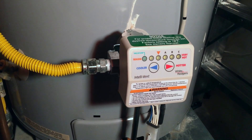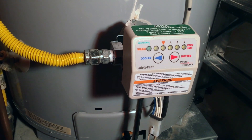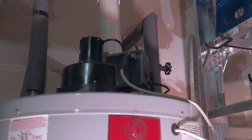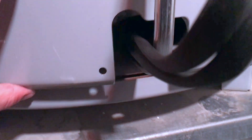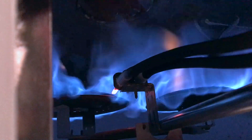What I had was some lights on this Intellivant that I'll get to in a second, and I did not have any hot water. The first thing that happens is the fan kicks on to evacuate the area. You want to take the access cover off, which I already have done. This is what a good flame rod looks like, and you can see how easily it lit.